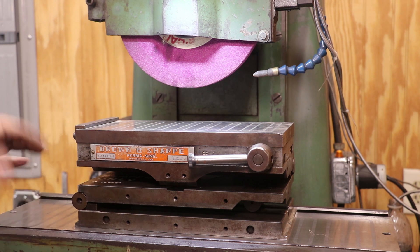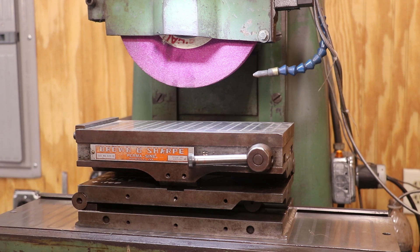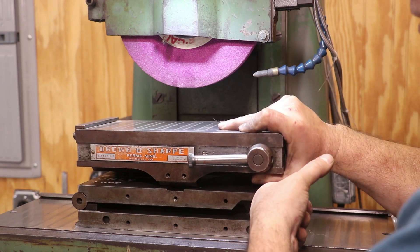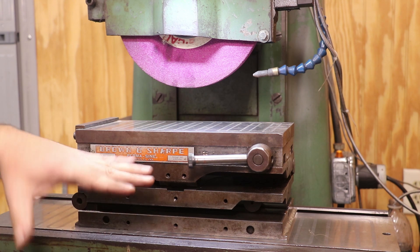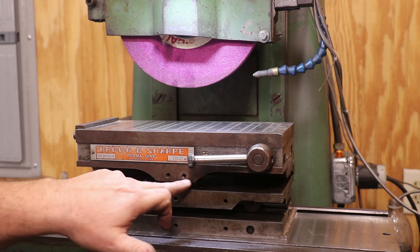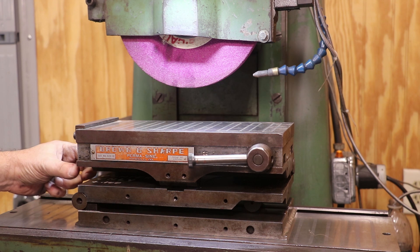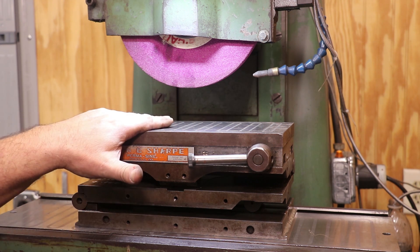What we've got here is a Brown and Sharpe magnetic compound sine plate. Why would somebody need one of these? If you're doing angles, or more specifically compound angles, this thing is perfect. There are actually two sets of hinges where this whole sine plate will adjust up and down — one axis goes this direction, the other goes this direction. Between those two combinations of angles, I can set a very precise compound angle or just a single angle. The way you adjust it is you put stacks of gauge blocks up underneath these points. It's on a three-point system — two hinges over here, one point rotates up. You put a gauge block in there at a very precise stack height and you can calculate what that angle will be, as long as you know the distance between the pivot point and the center of your resting point.